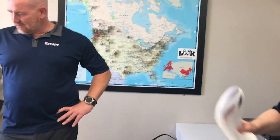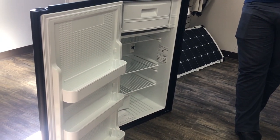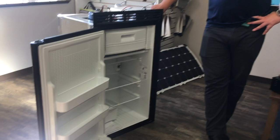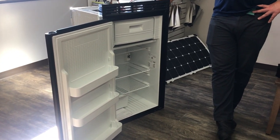This might be a really good use case for people who do extended boondocking and want their propane tanks to stretch for a long time. Maybe they have big batteries and extensive solar systems — it couples up really well with a lithium solution. A second use case is high altitude campers who request compressor fridges because they don't have any of the burner issues associated with camping at eight or ten thousand feet where oxygen can be a concern.